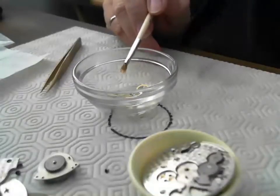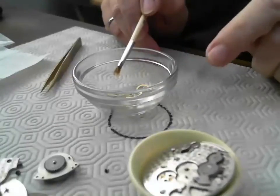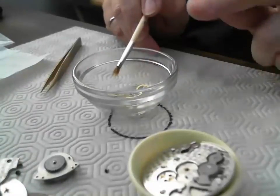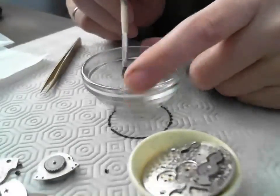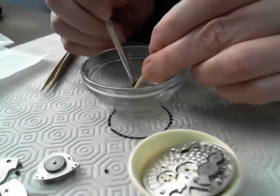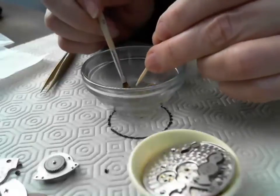And then it goes to the escapement, which is the one with the little tiny boots, and the escapement basically turns, and the pallet fork releases the escapement. It releases based on the speed of the balance, which is regulated by the hairspring. That's part of the balance. All automatic watches pretty well work the same, unless it's a tourbillon watch or one of these crazy $100,000 Swiss watches, which work slightly differently.